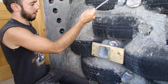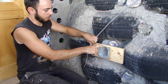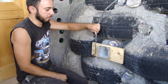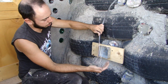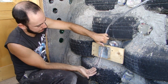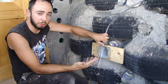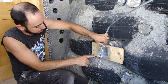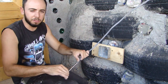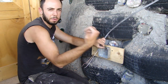Let's first go over how to mount the cable in the box. The box has all these little holes in it, and in order to punch one out where you want to run your wire, you just hit it with some pliers and wiggle it out — it just pops right out. In order to strip the cable, line your cable up so you'd have your length. I like about 8-10 inches of wire coming out through my box so I have a decent amount to work with, a bunch of slack when I'm wiring up my outlets or switches. You want a little bit of the Romex sheathing to come into the box. Before you ever mount this in the box, strip it out ahead of time — otherwise you'll be trying to strip it with your hands hitting the box and you'll cut up your hands.